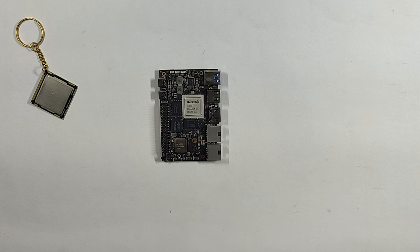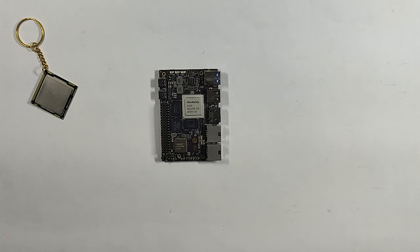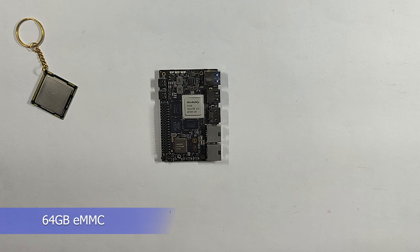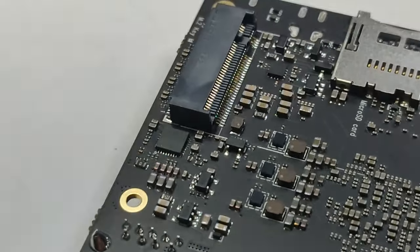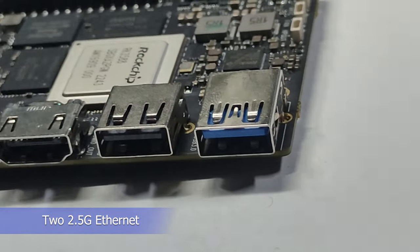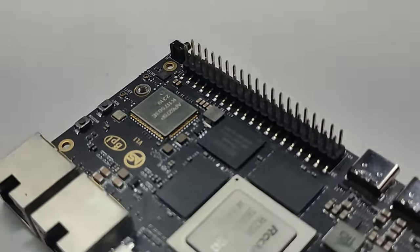L2 cache is 4x256KB. You also get NPU, VPU, ISP, etc. The RAM is 8GB — up to 16GB — and the board supports up to 32GB. The RAM is 64-bit LPDDR4X, not LPDDR5. Storage options are 32GB to 128GB eMMC; currently it's 64GB. There is an M.2 key slot on the back side. Two Ethernet ports are 2.5GB. Wi-Fi 6 and Bluetooth 5 are supported out of the box.